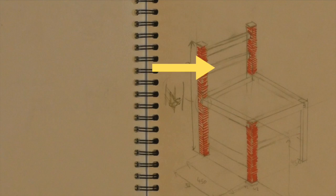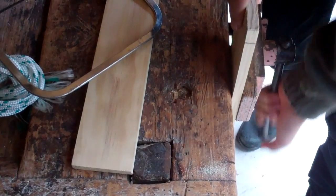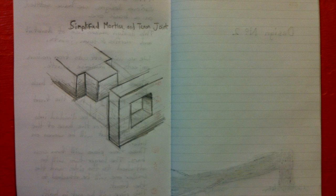The backrests were going to be connected by mortise and tenon joints. However, the wood used was too thin to cut into the face. As a result, we settle on a joint that involves a mortise but has a simplified pin.